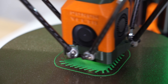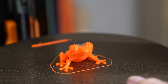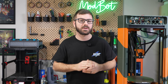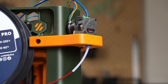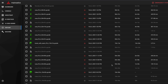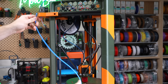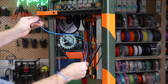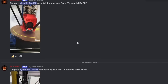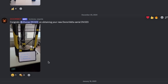The swap did resolve my issue of under-extrusion after retracts, but my corners are still really round even after multiple PA tests, and I haven't been able to fully remove the stringing. I've learned a lot in the process but I'm at a bit of a loss as to what's causing these issues. I have a hard time believing it's something mechanical, which points to something between the filament being fed into the extruder and coming out of the nozzle. My next step is going to be to flip the extruder and run the Bowden tube through the side, which will shave off maybe 200 to 300 millimeters in length. If that still doesn't resolve it, I'll likely convert the printer to direct drive.